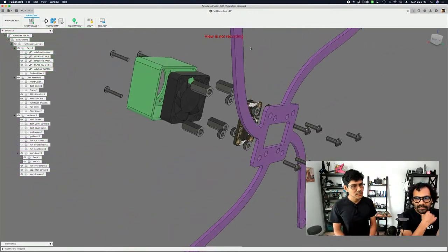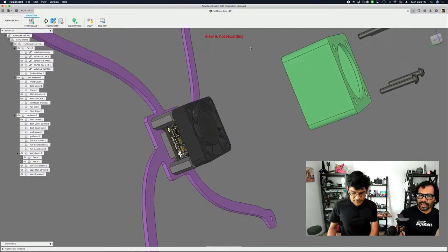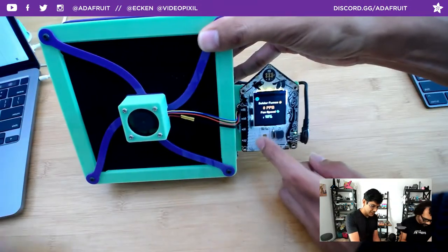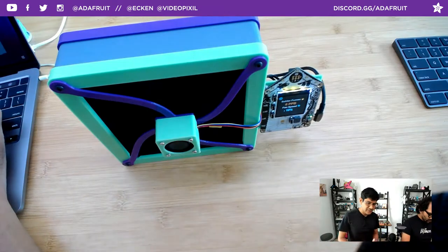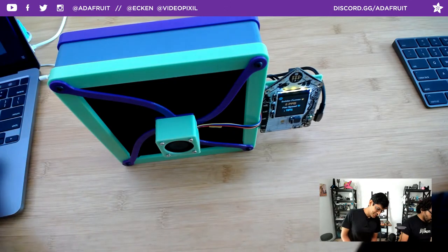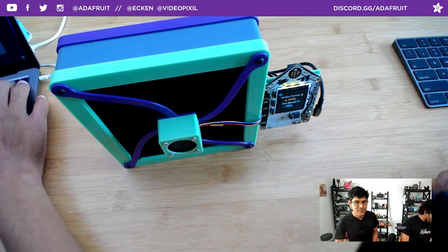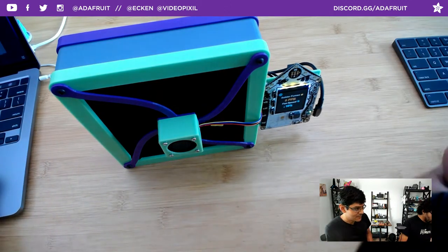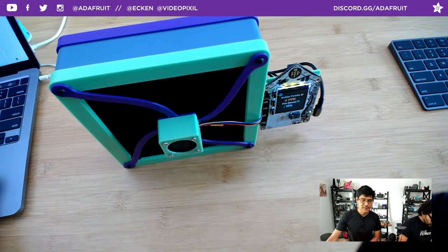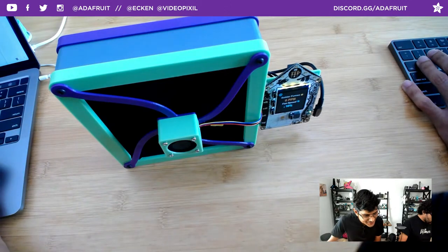The hardware. So the other thing I think you might have mentioned already was at first you thought that it wasn't working, but it needed to rest for about how long to accumulate the air. Good point. Yeah, the sensor has its own kind of things here. Right now it needs to acclimate. It needs a couple of hours to sense the room and sense the air quality in the room for a little bit. So right now that's why it's set to zero. But you give it an hour or so and it'll start taking in proper readings. And you can log all that and see it all in the REPL too. There are some other things you can do to calibrate the sensor. There's some documentation to take a look at. But yeah, that's the skinny. I had to let it sit for a little bit before it was getting good readings.